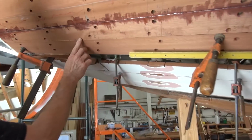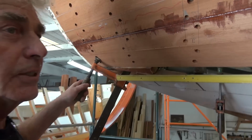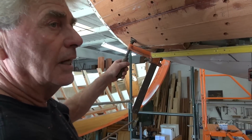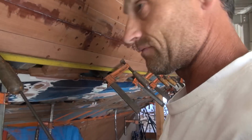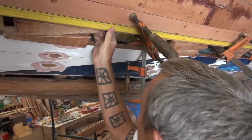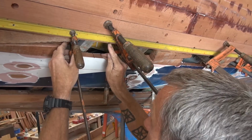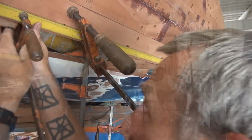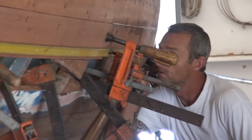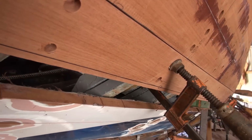See these notations here? Yeah. Those are the heights. No, the height in boat building can also mean how low it goes. Height is anything relative to an existing line that's horizontal. Weird language, huh? Well, some of the old plank lines, when we took the old planks off, they weren't fair. Now, what are you looking for there? Well, I made these marks right here. I already pre-marked them, the heights of the old plank lines. It's pretty decent, huh? The line is drawn.